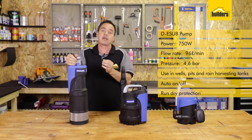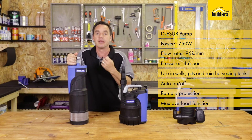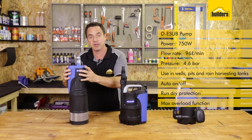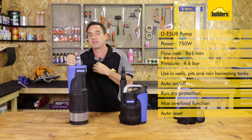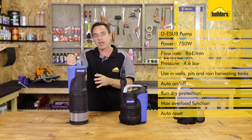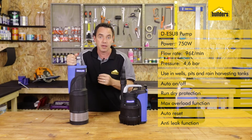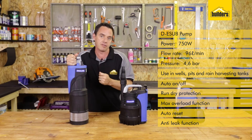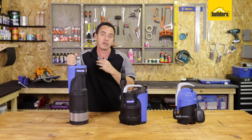It also has a maximum overload protection. If the pump is running for too long at high pressure it identifies that there's potentially a broken valve somewhere, and it'll turn itself off and go into a reset function. It'll then use electronic testing to check if the issue is still there and keep checking until it resets itself. It also has an anti-leak function: if you've got a slow leaking toilet or a dripping tap, instead of the pump turning on and off all day wasting water, it'll pick up the frequency, analyze it, and turn itself off into safe mode until you can get that leak sorted out.